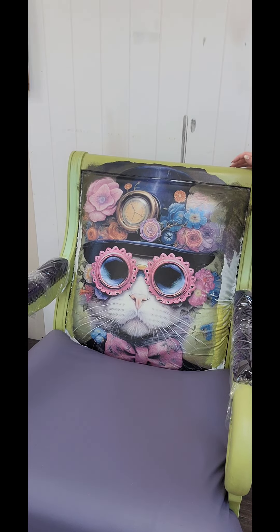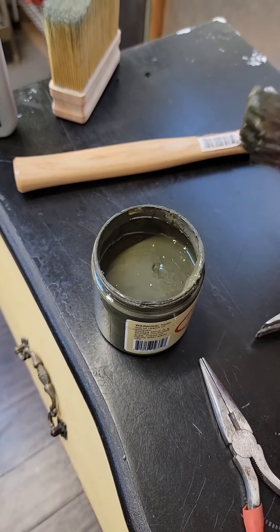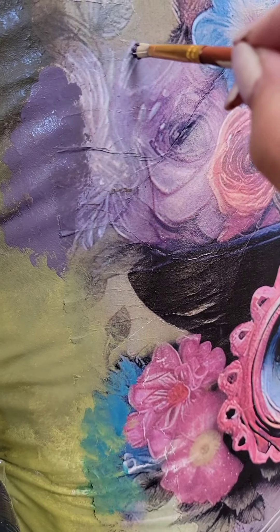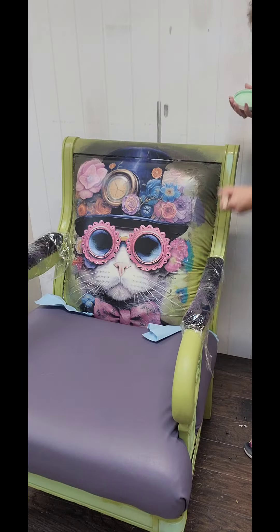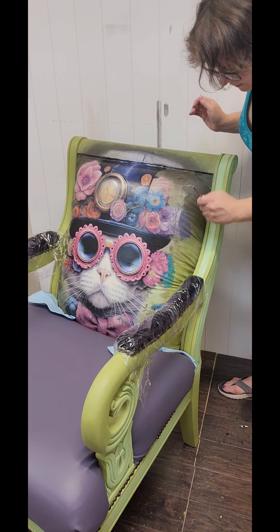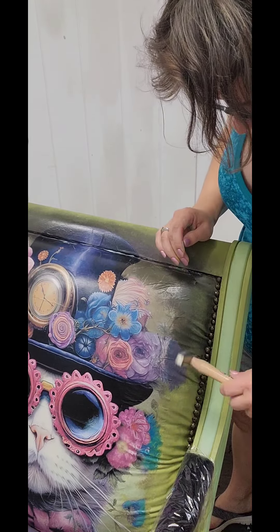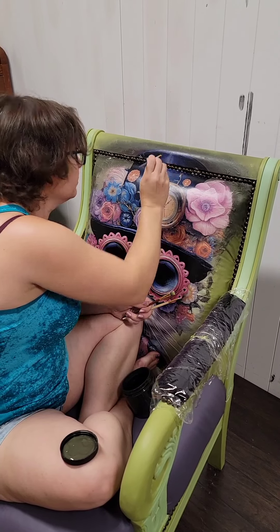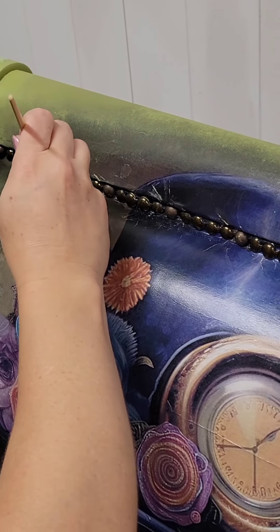I still needed to paint the image into the back of the chair. I had to do a quick calculation and figure out how to protect the velvet so that I didn't get any paint on it — saran wrap around the armrests solved that problem. I'm just using different shades of Dixie Belle paint and Paint Couture paint to take the image background and just blend it into the back of the chair. This is Collard Greens from Dixie Belle, and this is more of the plums and roses that I use to blend the flower off the edge as well. This is where you can have some fun with it — you can accent a color that you want to bring into the image. You can pull any color from the background and just spread it out and make it a bigger part of the image. I had a good time playing like a watercolor painting. I had to put on more of that blasted nail head trim — although it was a little bit easier doing it around the edges of the chair than around the seat and armrests, which was quite difficult. But I think the nail head trim really made the look and it was important to have it. I used a small artist brush to go around the nail heads and make sure nothing was showing white through the back.